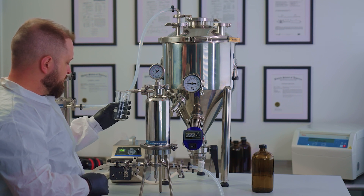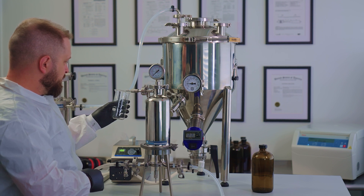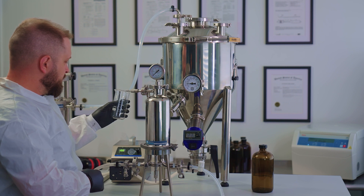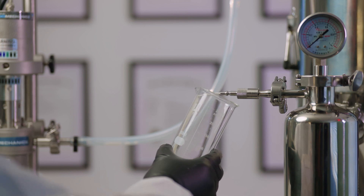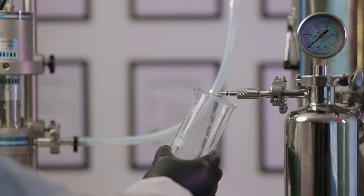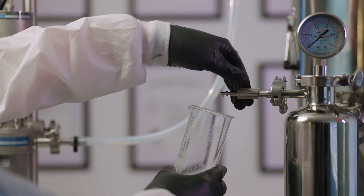This might take some time. In this case, the pump speed is set to 100 RPM, which is the recommended setting for filtering nanoemulsion made with nanostabilizer LSO. See the nanostabilizer user guides for details. Once liquid comes out of the bleed valve, stop the pump immediately and then close the bleed valve. The collected liquid, if any, can be returned to the tank.